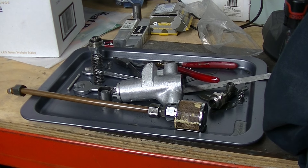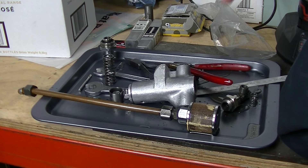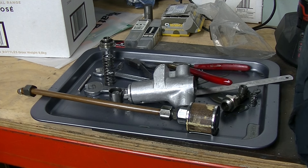G'day there guys, this is the old goat back again. I've got the oil pump out of it and I discovered a few things in the process. There are some plastic bushings for the three mount bolts - a top hat shape that fit inside a recess in the main shaper body, into counter bores, meant to seal the retaining bolts as they go in. Two out of the three have gone missing. So I'll have to knock some up out of a bit of brass or whatever. Thank God Mike's coming tomorrow to put the power on the lathe so I can do that sort of thing. I'm a little bit surprised that this thing ever worked.